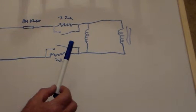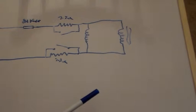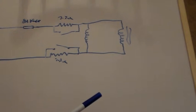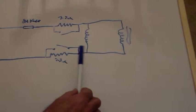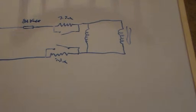That's what I'm hoping. Now it may be, because I haven't seen this arrangement used anywhere, that's why people don't use it, because you can't get rid of that. If that's the case, I'll go back to a DC arrangement. It's a bit of a fiddling around, because this transformer doesn't have any low volt windings I can use for that, so I'll have to do it with the HT. Push comes to shove, I'll do that, but I would prefer to do it like this. So I'll get another relay, and if the other relay just goes click when it gets to a certain voltage, then I'll be delighted, and that will be a line drawn under that, and then I'll have the circuit diagram that I'll actually build, and get rid of the bird's nest and build it properly.